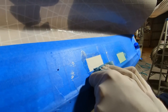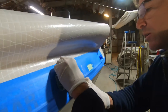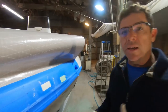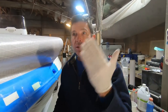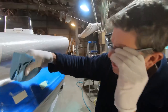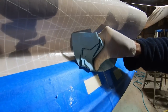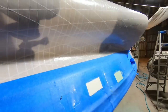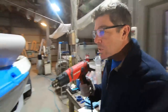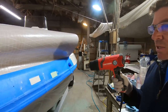It's okay if it's over full — from experience I've seen people put a coat or two of gel coat in, wet sand it, and it's too low. They didn't fill it enough and you've got to come back and fill it again and again. It is much better for your fill level to be a little over full. Before we spray some PVA on this, I'm going to warm this up just a touch with the heat gun. Remember this thing throws out a substantial amount of heat — you want to keep moving.